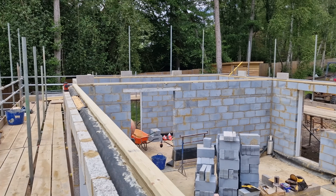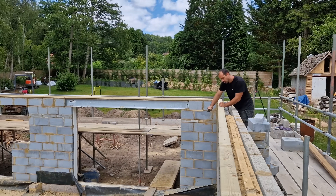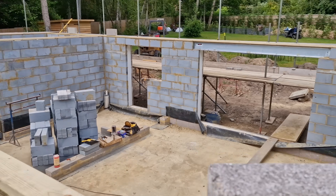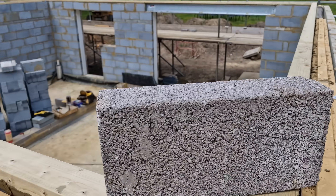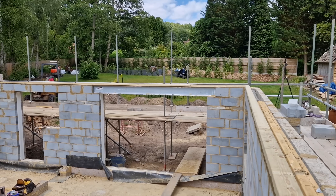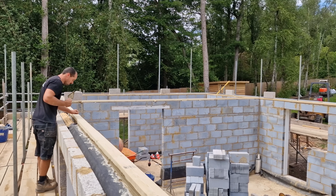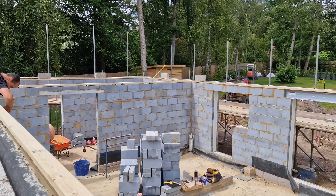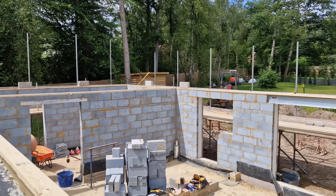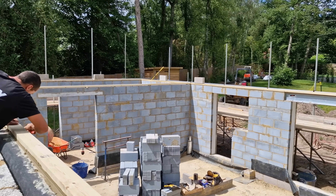The plates are all on, everything's fixed, all the corners are screwed. Callum's just pointing up the backs and fronts, getting them all lovely and neat. We're weighing them down with blocks because once the sun gets on them they'll want to bake and curl up — but that's fine providing the muck is nice and flat underneath, because they'll just go straight back down when we put the restraint straps on. That's that job done. Now I'm going to show you how I do those halvings you saw in the time-lapse — how we do them so fast and so clean.